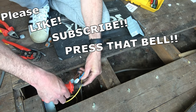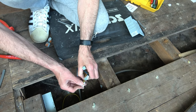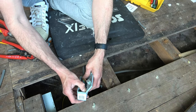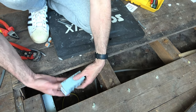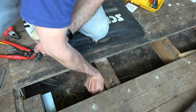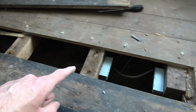With the earth wires, I get some sheath, place it over the top and cut it to length, then place those in the connectors. With that done, we stuff the connectors down into the end of the box, pushing all the wires in neatly, ensuring the grey sheath is housed between the gripper and the base of the box. Once that's done, we clip the lid over into place and slot it over the clip on the joist. To make the junction box maintenance-free, you need to put a cable tie through it securing the lid to the box, but as I may need access before I've decorated the room, I'm going to leave that for another day.